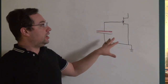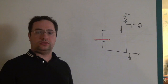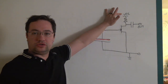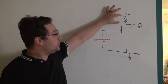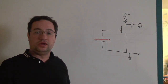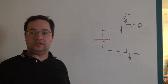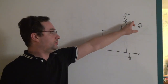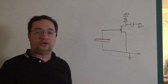The problem with this is that the JFET requires power. The common way to provide power to this JFET common-source amplifier is by having a pull-up resistor to some sort of power source. The voltage of the power source and the resistance value sets what kind of gain you get out of the amplifier. Whatever you're hooking it up to is expecting AC, because that's what a common audio signal is, and so you have a DC blocking capacitor which blocks the bias you're putting onto the amplifier.